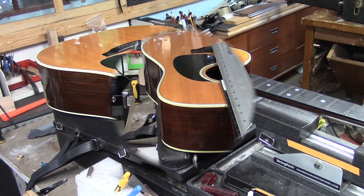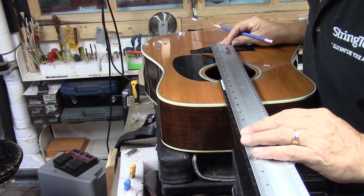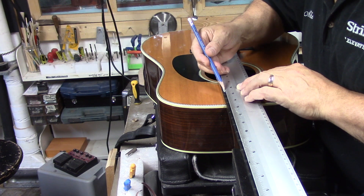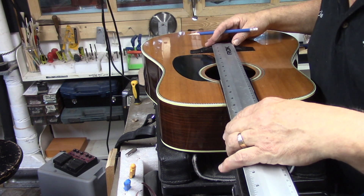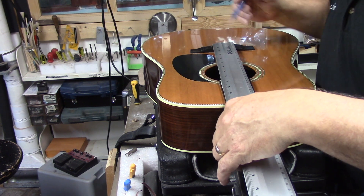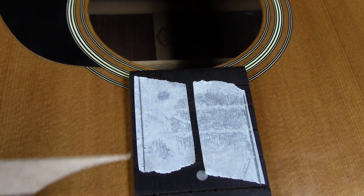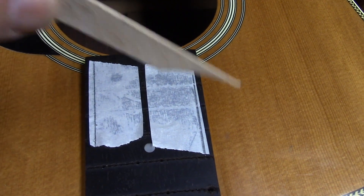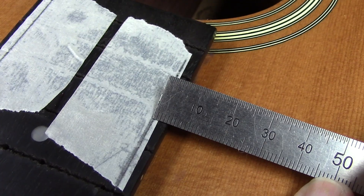So let me walk you through a couple of steps here. First thing I'm checking is I've got a straight edge up against the slot of the first string, going to the first string peg hole. I've got a piece of masking tape on there and I'm just going to scribe a pencil line, then move over to the other side — same deal for the sixth string, going from the sixth string nut slot to the center of the bridge pin hole for the sixth string. I'll scribe another line here. Here is the trajectory of the first string, here is the trajectory of the sixth string — that's good. We've got equidistance from the outside of the fingerboard to the center of the string on both sides: four millimeters and four millimeters.